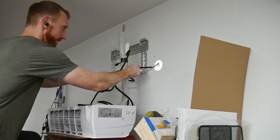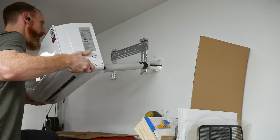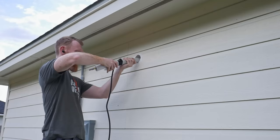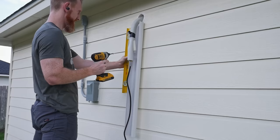It's then time to transfer all of these lines through the 3.5 inch conduit and hang the unit onto the bracket. This wall unit is pretty light and mounting it was easier than I thought. I then carefully bent the lines coming out of the shop downward — you want this bend to be as curved as possible so as not to kink any of the copper refrigerant lines. I packed the hole with the putty that came with the split system and also went back with some spray foam to make sure this section was fully sealed.